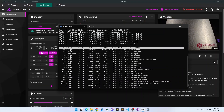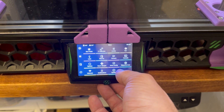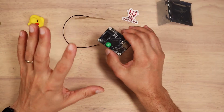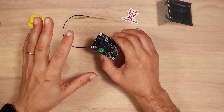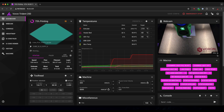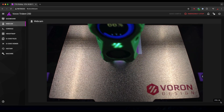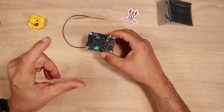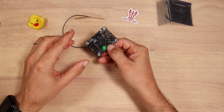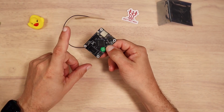After the test print, I noticed a very weird issue where one of the CPU cores was under 100% load and my TFT screen had a very slow response time. I was able to solve this by removing the OBICO packages — not sure if it was fully related, but it solved the problem. Also, while printing, I noticed that my Logitech C930E camera was finally able to pull 30 frames of video feedback via the web interface, which I was extremely happy to see, as my CB1 model struggled to output a consistent 10 frames. I had tested before and found that this issue on CB1 was related to its slow Wi-Fi — this is where the upgraded wireless module on CB2 comes into play.